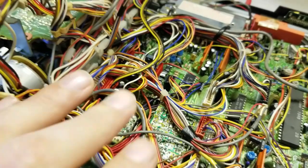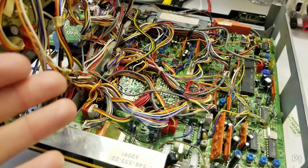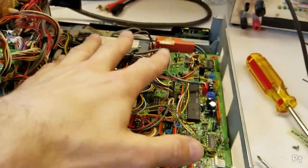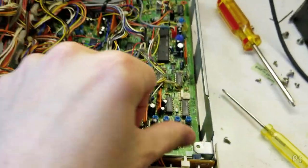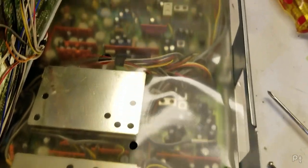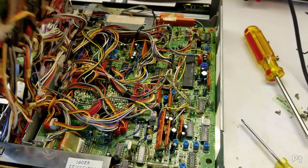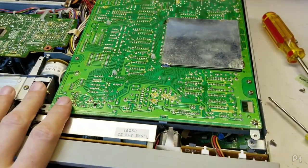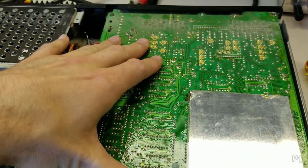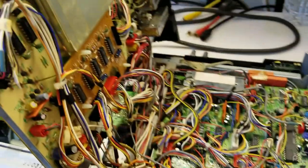Without a schematic I can't trace what the 9V rail feeds. There are additional circuit boards that also flip up — you remove a screw here and another here, with just a little plastic insulator in between, to get access to even more complexity underneath. One thing that disappointed me is that while the top board is nicely labeled, this lower board is completely unlabeled — it looks like it's custom to this model, not shared with the SL-2500.